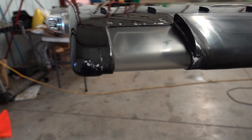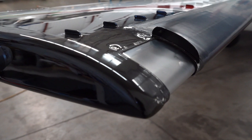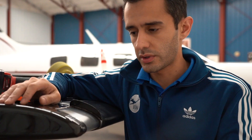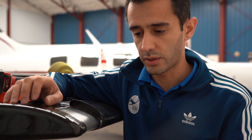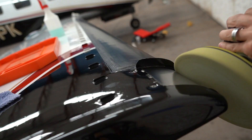These lenses are a common PA-46 issue — they're plastic. You can polish them, you just want to make sure you don't get them too hot because the heat can cause crazing or even melt the plastic. If you're going to use a rotary, use it at a lower RPM and don't use too much pressure. We're going to start with the yellow pad and hyper polish and see how that comes out. If we need more cut we can step up to the wool pad, but either way we'll be running at minimum speed — six or eight hundred RPM — and light pressure.